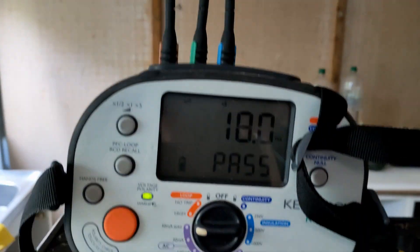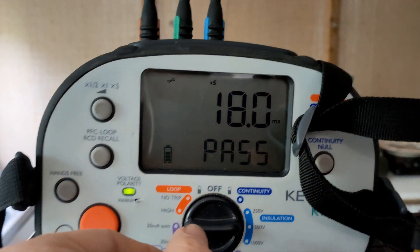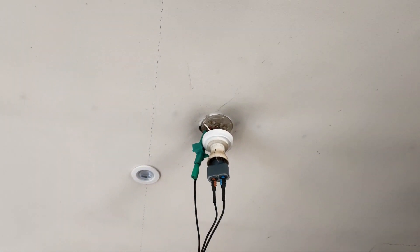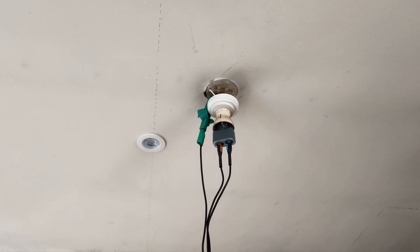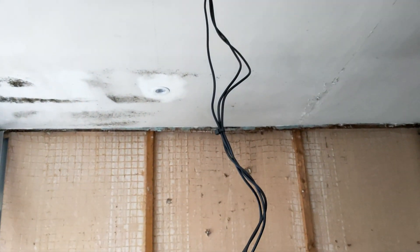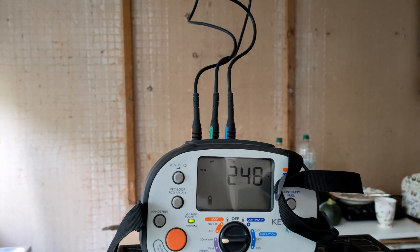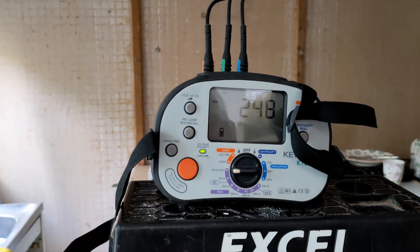So that was reasonably straightforward in the end. What we're going to do now is power off the QTEC box and power off this particular RCBO, and we'll screw that back into the ceiling — just to be all nice and safe. You don't want to be screwing that back when it's still live.